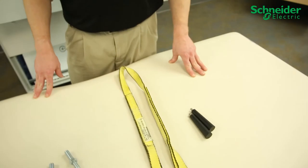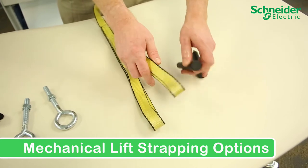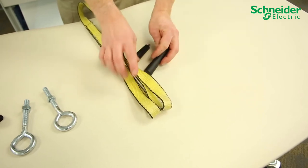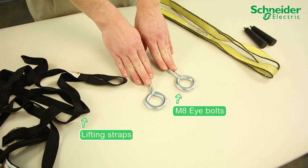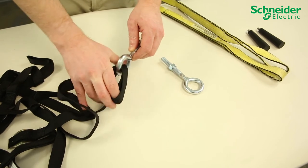When using a mechanical lift, there are two ways of attaching strapping to the CL60. Firstly, the supplied lifting handles installed on the CL60 can have a lifting strap placed over the top. Secondly, you can replace the top handles on the CL60 with M8 eye bolts, where a standard lifting strap would slide through the eye bolt and be used to lift the unit into position.